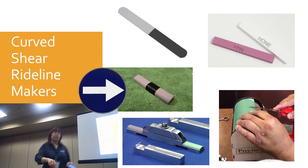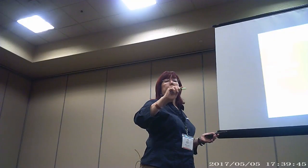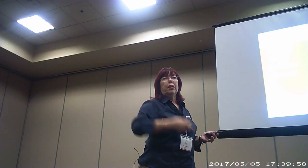This is what I use — I'll pass it around. It's a 2000-grit shaft and stone that we send to the people who do granite work on cabinets; they round it off. I put electrical tape on it: one single layer on one side and a double layer on the other. The blade is flat but has a slight helical to it, so the distance between the back spine and the edge changes as it goes down. So I use the round side with single tape up to a certain point on the blade, then flip it for the other side. After using it a while, I mostly don't even bother with the tape because you can feel it with your thumb as you go across.